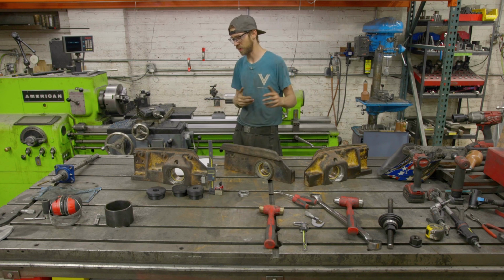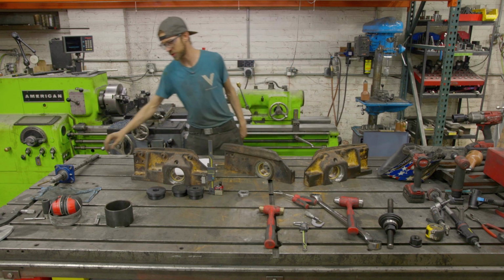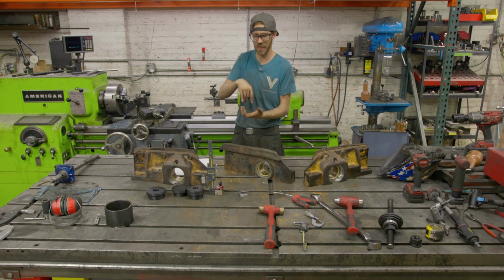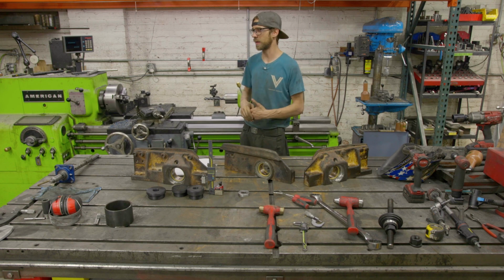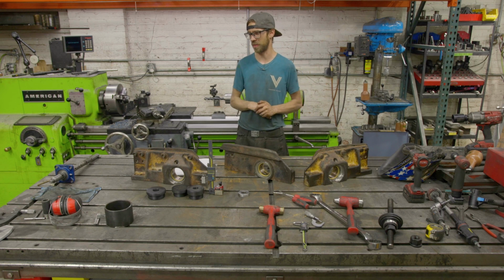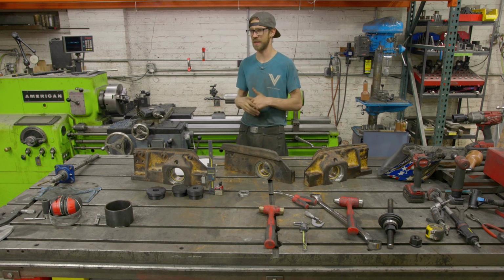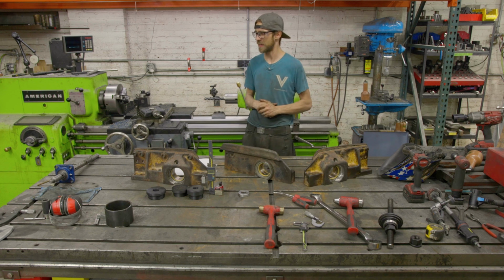I'd have to hammer the bar out, and I'd have to take it over to the lathe, and I'd have to polish it, and it would have all these drag marks from hard material that got trapped between the bearing and the bar, and it damaged some of the inside of the bearings, so I had to flap wheel those out. And as I moved along, it got better and better as I kept an eye on blowing air off the bearing mounts and being more eager with the lube and several different things. So towards the end, it got better. In hindsight, having the bearing below, probably not the best case.